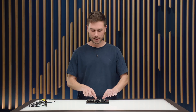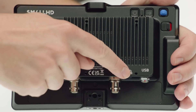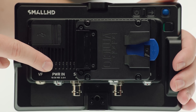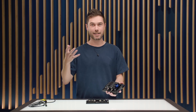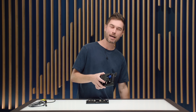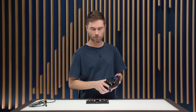On the back of the monitor there are accessory mounting holes — four M3 holes which have been designed to accommodate a number of third-party micro battery plates. Here's one I prepared earlier: a Bebob plate, but Anton Bauer plates will also fit. This is really handy where you need to power the monitor at a distance from the camera. For our car rig shot we used a long 10m viewfinder connector and had a little battery on the back of the monitor for extra brightness, using a D-tap to RS-IN power cable.